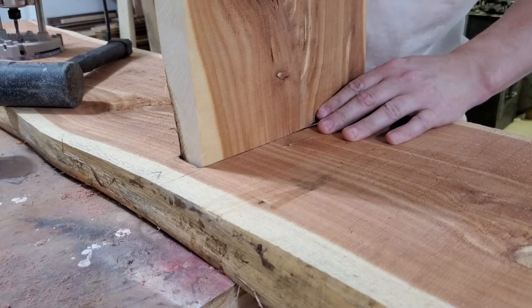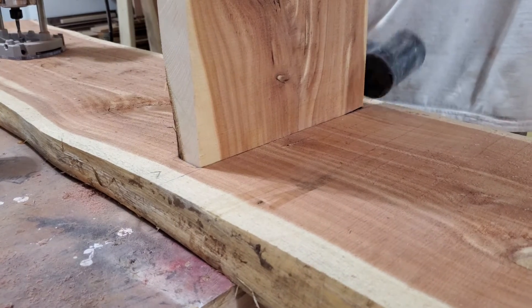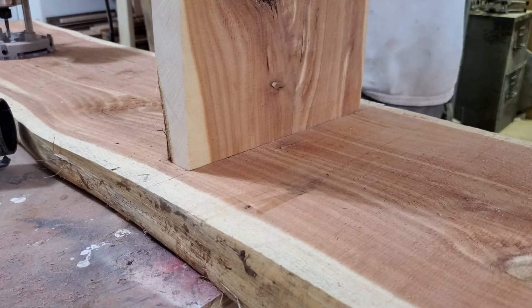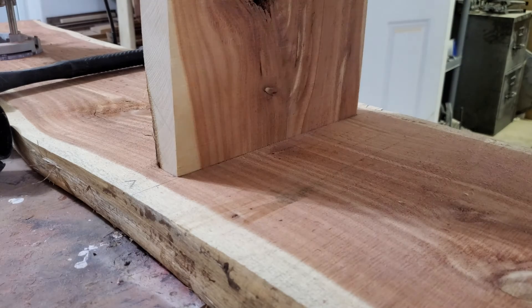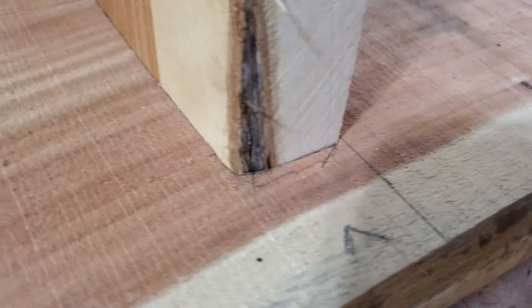I've removed about three-quarters of an inch of depth and I'm just checking the fit right now, making sure we don't have any major issues — which luckily we didn't. Everything fit really well. From here it just needed to be deeper, so there was about another half inch of material to remove with the router, plus a little bit of chisel work just cleaning up the edges and making sure they're nice and flush. I won't torture you and make you watch more of the router removing material, at least for the legs anyway.